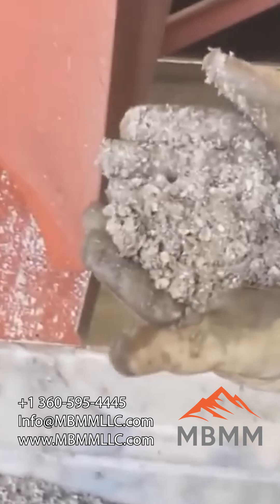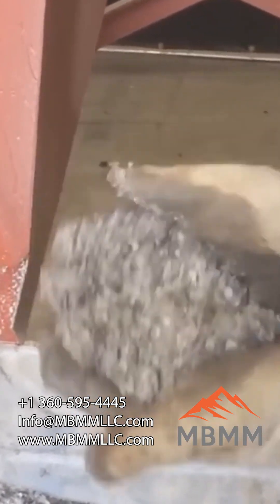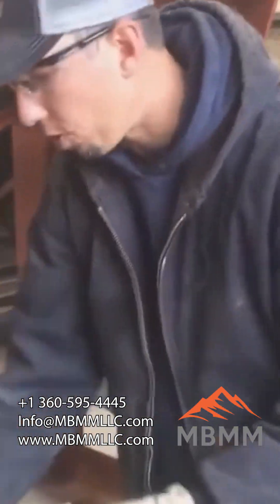This was a three-quarter inch screen with round holes. If you're interested in a smaller size than this, we can certainly make smaller holes at half inch or even quarter inch, or bigger holes. By adjusting the hole size up or down, it's going to play with throughput a little bit.